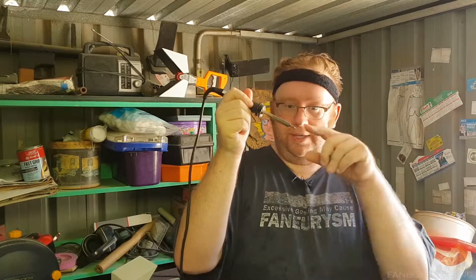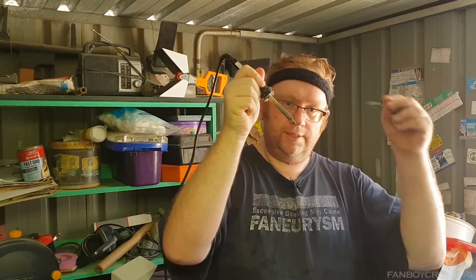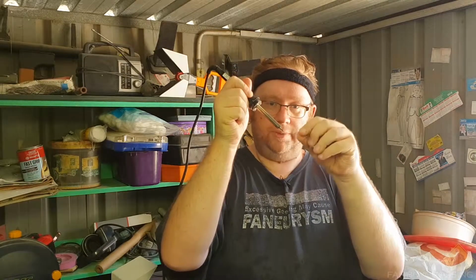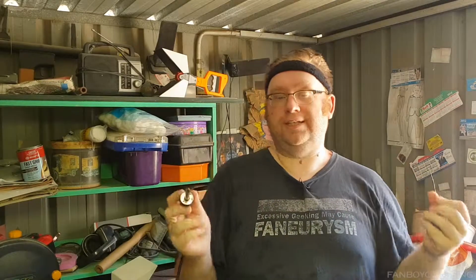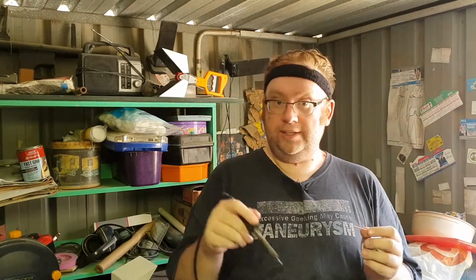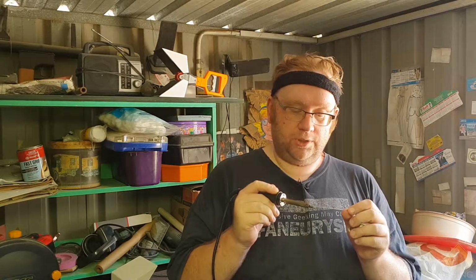So you've got a component here, you've put down the heat, put down the solder, you kind of push it in, wait for it to melt, add a little bit of solder to the circuitry and the component, lift off, that's it. But in theory, that's all well and true, but in practice, there are things that can go wrong.